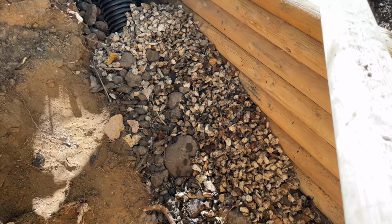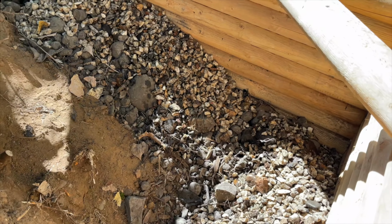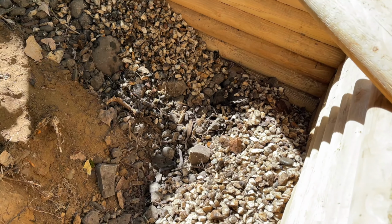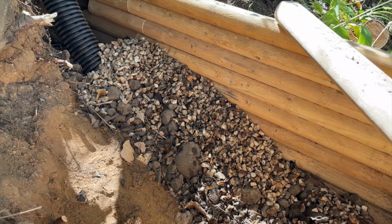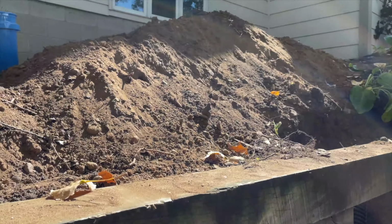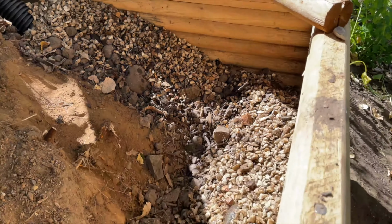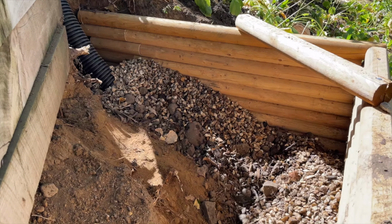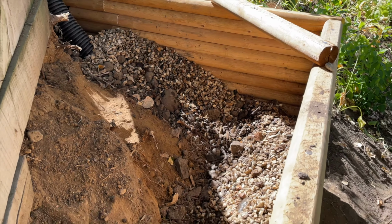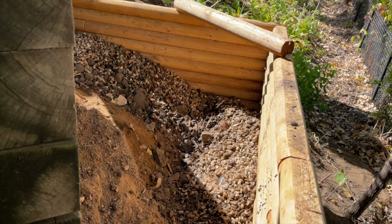And we do that because those allow water to pass better than soil. So you do the most porous to the least porous. So we have rock, smaller rock, gravel, and then soil. So now what we're going to do is start putting in all of this soil here, or this gravel. And once all the gravel and sand are in as much as we can, then it will be time for the soil. So the next video will show you all of the gravel placed in this area.